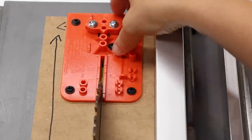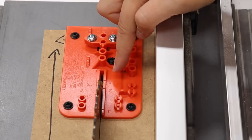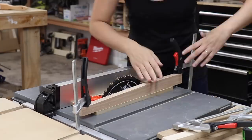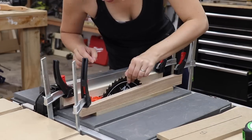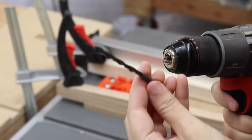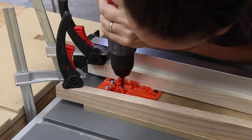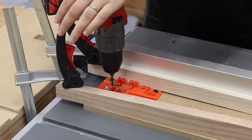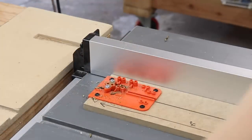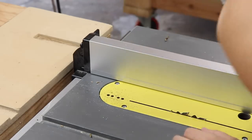Next, raise the blade all the way and rotate the blade so that the first exposed tooth at the back is lined up with the 3-inch alignment mark on the setup board. Before drilling, make sure the setup board will not move at all — clamp it down to your table saw and confirm the blade is still aligned with that 3-inch line. Lower the blade all the way. This kit comes with the drill bit you need. Follow the holes in the drilling guide block, drill super fast in one fell swoop, and all the holes will be in the correct location. Just chamfer them a little bit to leave room for the splitters, and you're done.